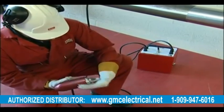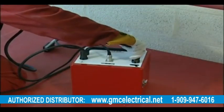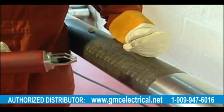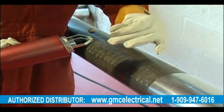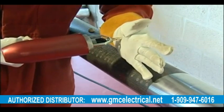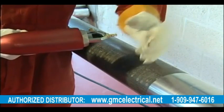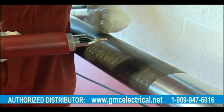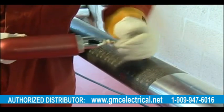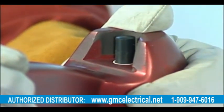Loading the gun and preparation to braze. Grind as required. Attach the earth device securely to the battery box. Attach the brazing gun securely to the battery box. Check the previous fuse has been ejected. Carefully insert a brazing pin which should have a straight fuse wire with the kinked end still intact, as this will gain optimum contact with the contact nipple inside the gun. Make sure the fuse wire does not get jammed and push it hard and fully into the pin holder — this must be a very tight fit. If the pin is not a tight fit, it is possible that the jaws of the pin holder have become flared and will require adjustment. Insert the ferrule with the serrated edges outward — again, this must be a tight fit. Place the pin tip directly against the substrate inside the cable lug where required and depress the solenoid fully toward the required braze surface.